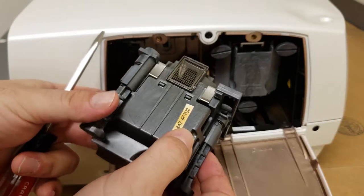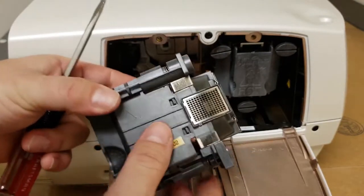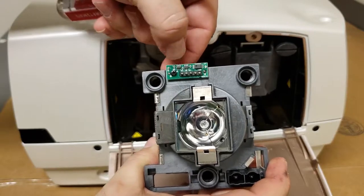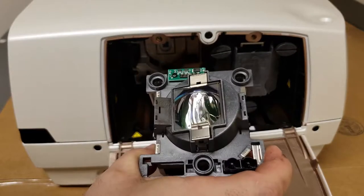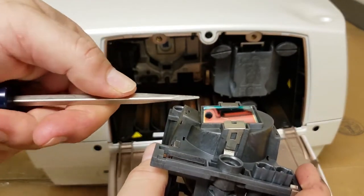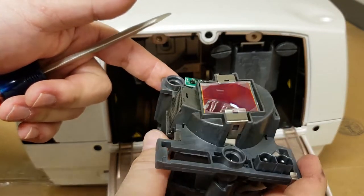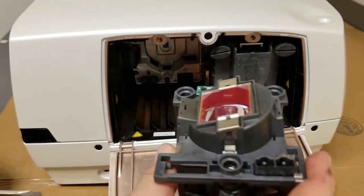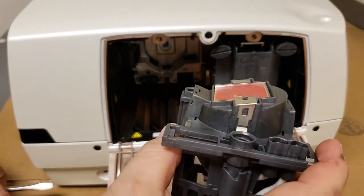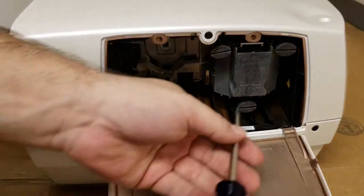These particular lamps have a decent amount of time on them. You can kind of see the heat started to get to this label. These lamps also have an integrated lamp hour counter. This chip and board here keep track of the amount of hours that the lamp runs for. One thing to always look for, especially in your new lamp, is that it has this reddish blue reflective coating that blocks the infrared light from getting inside and damaging your projector. Not all lamps need it, but if your old lamp has that reflective coating — you can turn it like that to see — your new lamp should have it too.